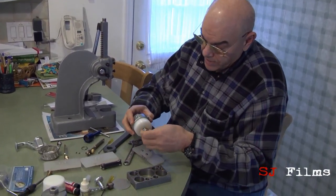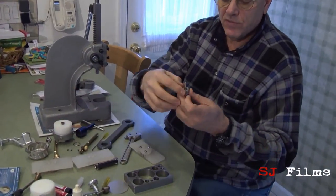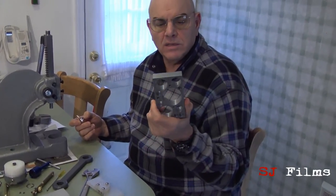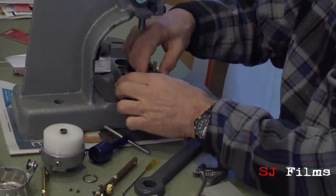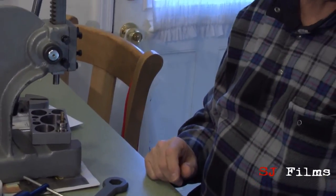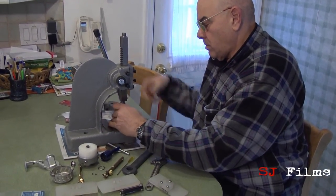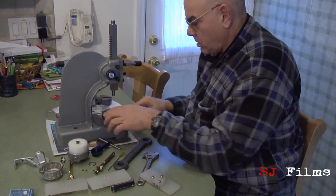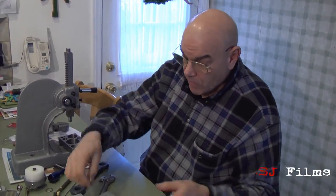This is reverse thread and now the pinion has been removed and we're looking at the sleeve guide and main bearing. This is what I refer to as a press plate — it's another item you can pick off of eBay, it's really inexpensive, about 20 bucks. You never want to bang on the brass sleeve guide, so use a little piece of soft nylon. This is your bearing — you can check it. This one feels fine and it's really old.